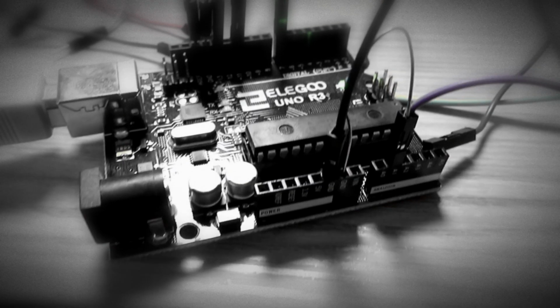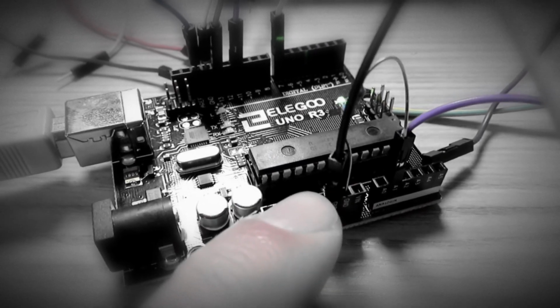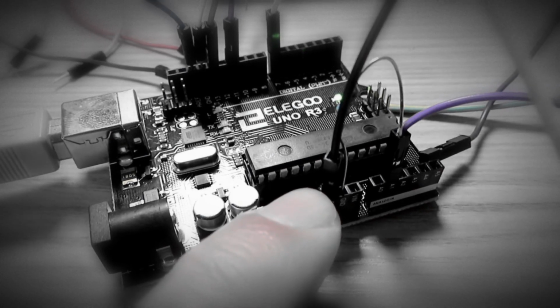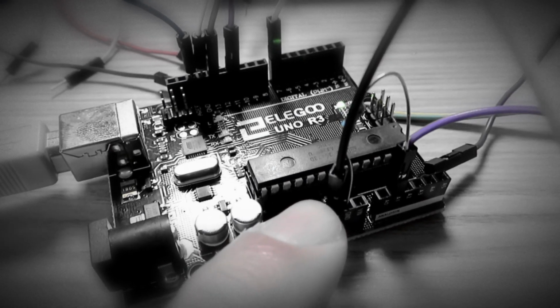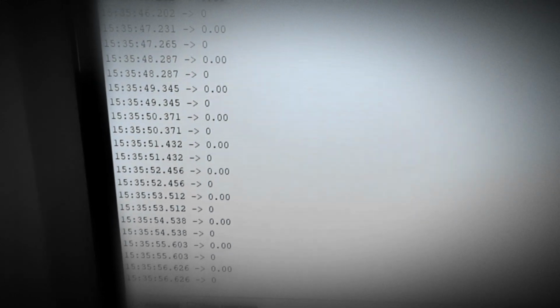My design goal here is to make a customisable low-cost PMR FRS Parrot repeater for less than £10 UK. It has to be small and light, easy to operate and stable. I'll try and cram a battery in there as well. The unit will basically record any audio that it receives and instantly retransmit that audio up to a maximum of 10 seconds on the same frequency. The repeater can, if required, announce its presence every 15 minutes, detailing the repeater's CTCSS tone. A CTCSS tone would be needed to prevent too many rogue retransmissions or the transmission of interference. The receiving radio could also be set with DCS access as well to improve security.